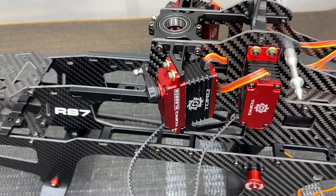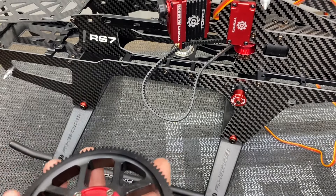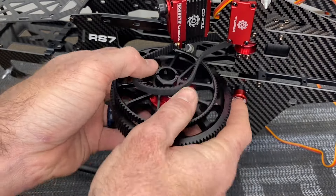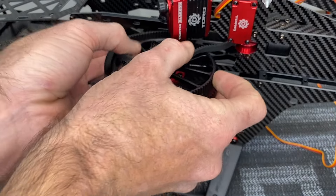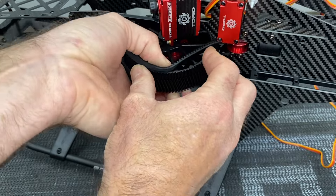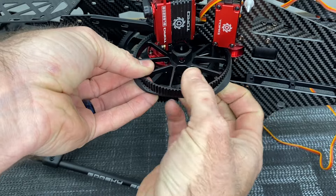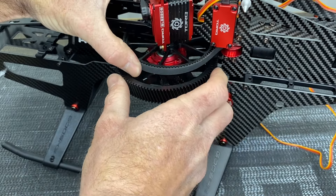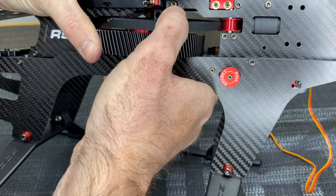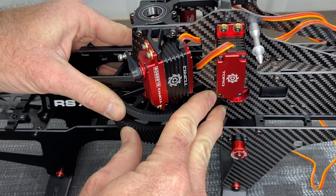The belt will hang out the side with the half-twist anti-clockwise already set. Grab the main gear — red side and screws face up — drop the tail pulley down into place and feed the belt onto the tail pulley. Work everything in at once, feeding and keeping it all together so the belt comes around. Don't push it too far through the other side. Work it in — it's a little tight but once you get it all together the main pulley and main gear are in place.